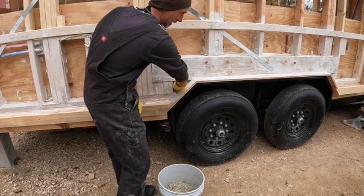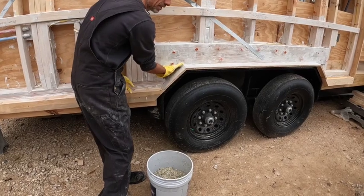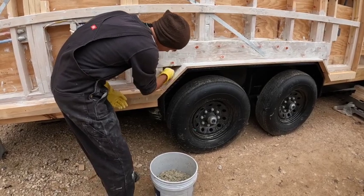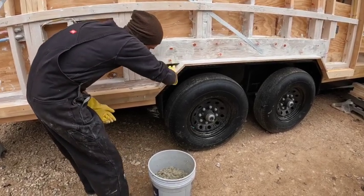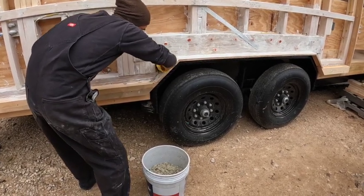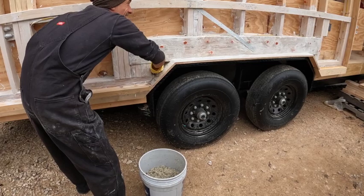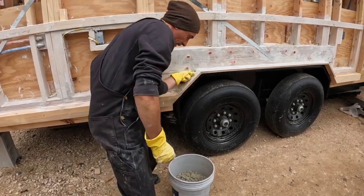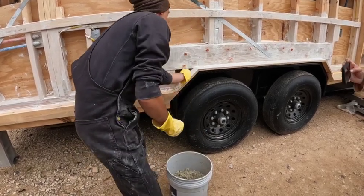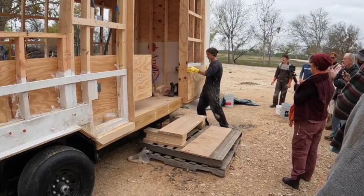Now when I take that foam off, you're gonna see that I had some really challenging corners down here. I can't get a poker in there or anything. So I just want to take a little bit, get it in that back, and work a little bit in. My watch is saying first hemp goes in 1444. Get it in there, and then I've got this corner way up here. It's even hard to get in there. Now I'm just gonna take a little bit and start pushing it up into that space, right? Like this.